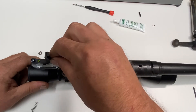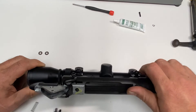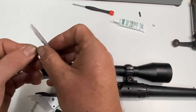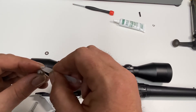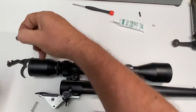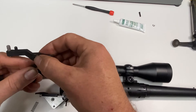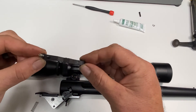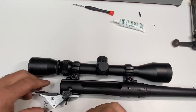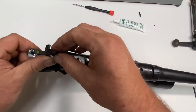Now, a lot of these Savages — see the play that's in these? This kit comes with these two shims. So basically what we're going to do is open up the Super Lube, put a little bit on there so it'll stick. It's going to go on this side. Take the other one and do the same — coat it real good and stick it on this side. So those shims are going to take up some of that back-and-forth wobble. Now I'm going to reinstall our spring and get it in this pocket.